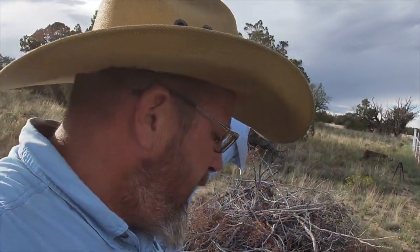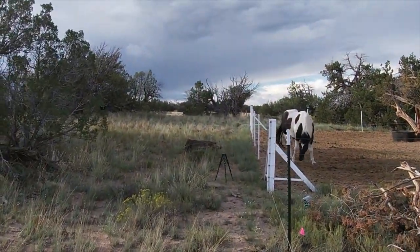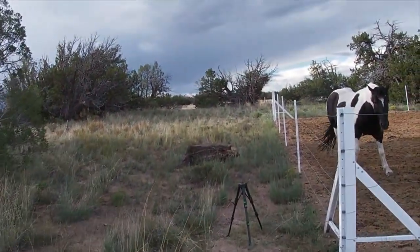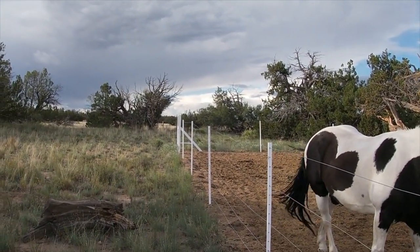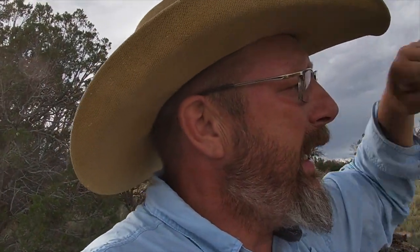Now on the other side, going out the other day where we set that post out there in the anthill, we're gonna run just high tensile, no barbed wire in the front. And we're gonna use timeless T-posts from here around. I think the front of the property will look a lot better that way. So all along the front, we're gonna use timeless. And then back down over the hill past the workshop up on the hill, we're gonna use timeless. So just to make it look a little nicer, it's all gonna be high tensile.